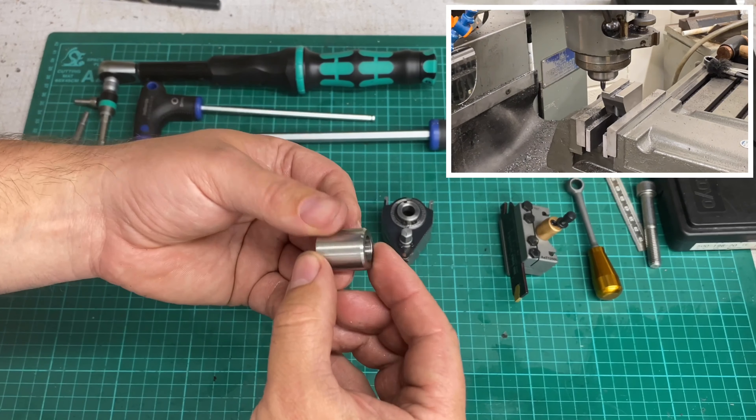I've just given it a bump - let's see how that looks now if I go back the other way. I probably knocked it out the other way now. Okay, that's within 10 microns - it's not perfectly straight but that's probably all it needs to be. Right, so that's square. I'll just give this one final little nip, and then the belt and braces will be the dowel pin when I pin this - and that will prevent any movement at all.